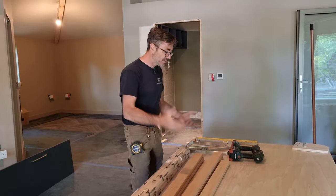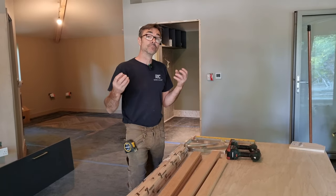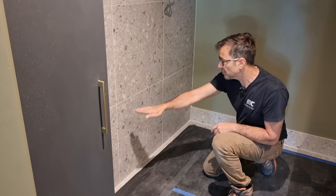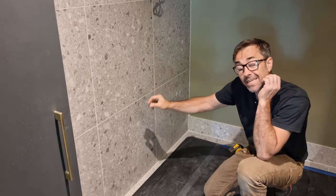You know what it's like, if you're going to sit on there wet and the water runs around, those screws may corrode. Or if your extractor fan doesn't work properly, moisture gets on that metalwork, it will corrode and it could stain the wood. So I'll show you where we're doing that. We're coming in here and it's going to travel through here from wall to wall, okay? It's going to consist of as many slats as it needs to have, and they're going to be spaced quite close together.